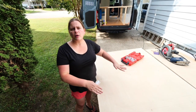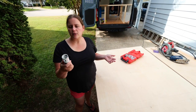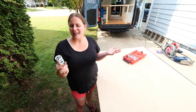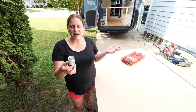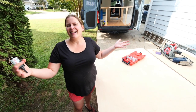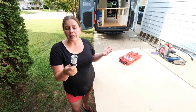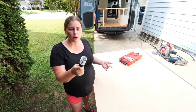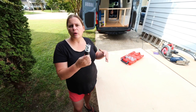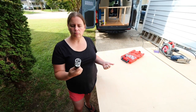So we have our two pieces cut for the top of our platform bed, and we are now going to drill some holes in it. Why are we putting holes in it? Condensation and moisture. In a small space with a lot of heavy breathing, you get a buildup of condensation and moisture pretty easily. Even in our bigger RV we got a lot of buildup. So we are going to put some holes in the platform wood so that hopefully that will give it a little more airflow and kind of prevent that buildup of moisture.